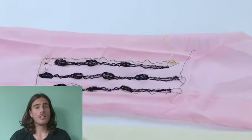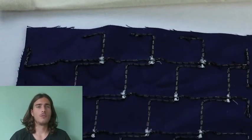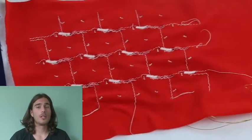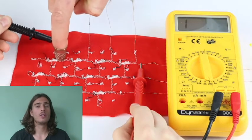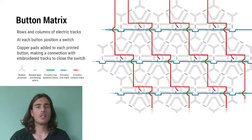Through abstraction and exploration, we pursued developing a textile-based sensing method that could functionally register presses. Therefore we chose digital embroidery, using conductive yarns and zigzag stitches to ensure flexibility and durability in measuring button presses. To ensure reliable sensing, we adopted the principles behind the button matrix circuit, using parallel tracks of conductive yarn and attaching conductive copper pads underneath each printed button. We formed an array of physical switches to register and transmit button presses.